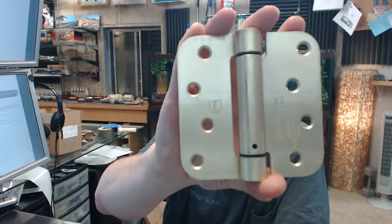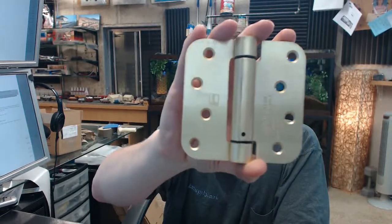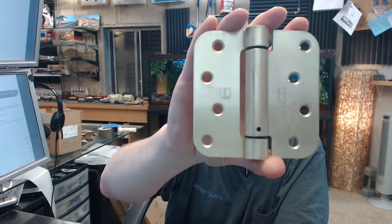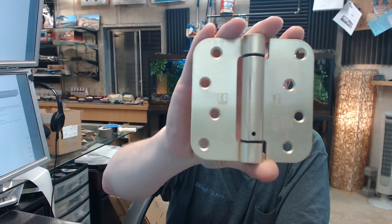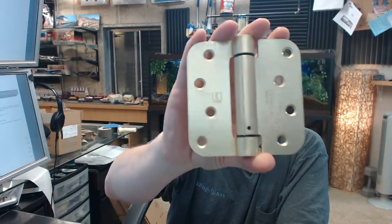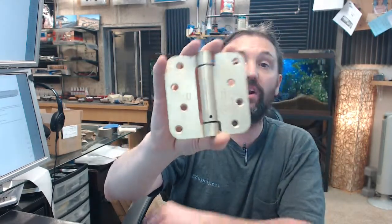This video is to bring you a closer look at the Hager number 1752 4x4 US4 satin brass single acting spring hinge, full mortise, residential weight, steel base. Let's go over what all that means.